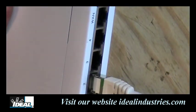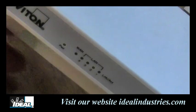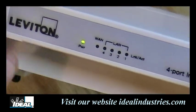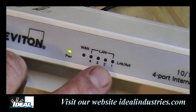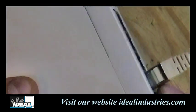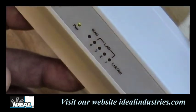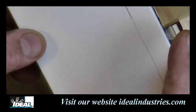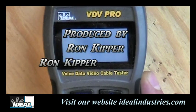And now the tester should be putting a signal out that will turn the light on in the front of this little router device. And sure enough, we see the power light is on, and it's blinking on number 2, indicating that I am plugged into the second port on the router itself. And that's a nice feature we can use when we're trying to identify certain cables back at a router or switch someplace in a panel. So that's the nice hub blinking feature of the tester.